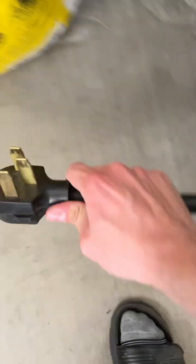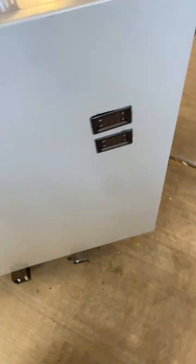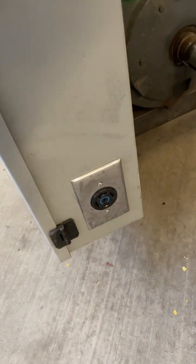This is my single-phase power. It's only 240 volts, 50 or 60 amps going in, and three-phase coming out — roughly 30 amp three-phase.